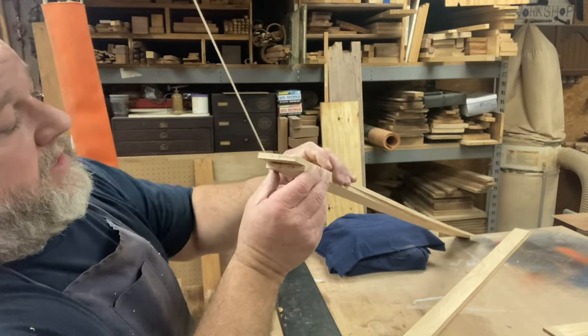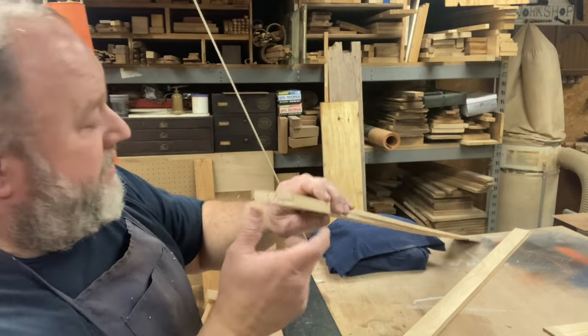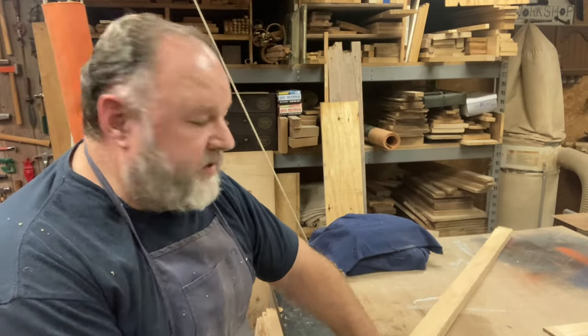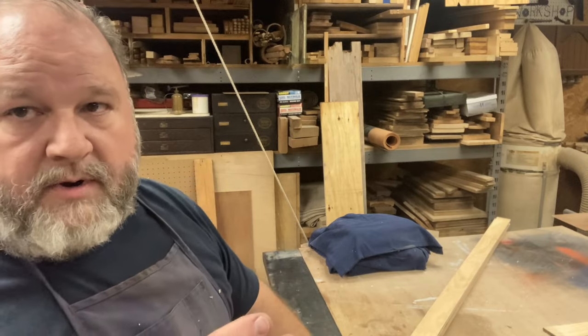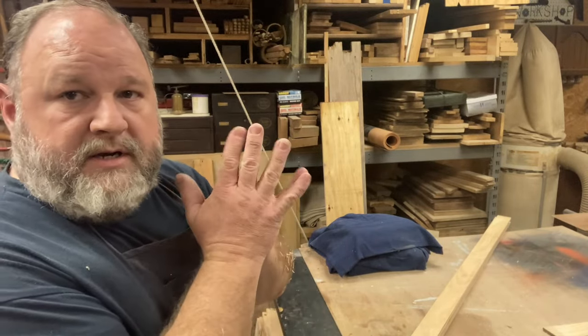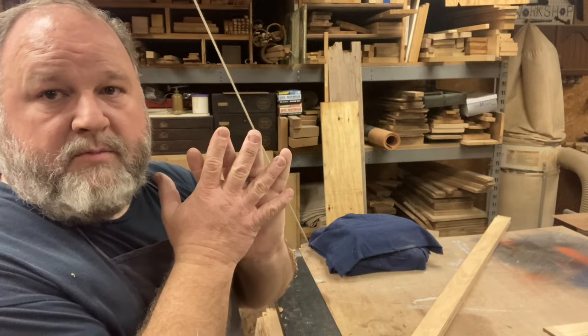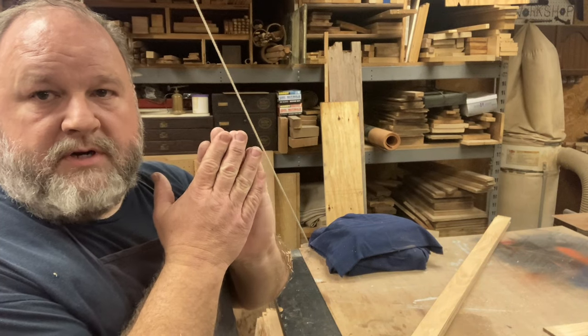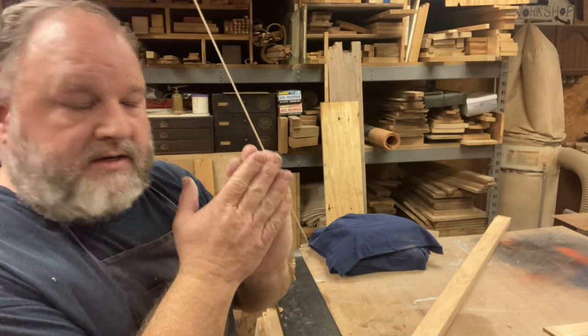And then we've got the 2 and the 1, which will go on the top. As I pointed out earlier, the grains are already set so that they are mismatched and will not run together, so that they will not split. They will be crossed so that they will work against one another and will keep everything together.